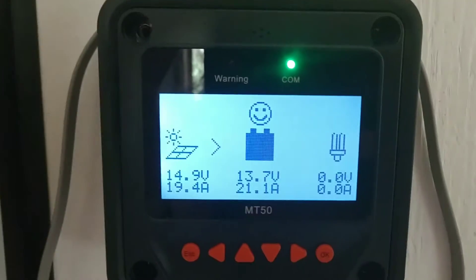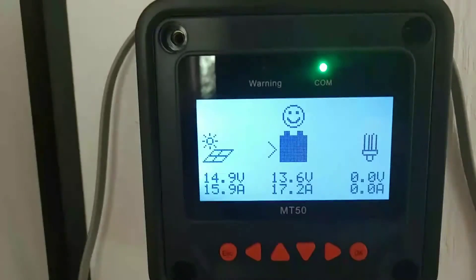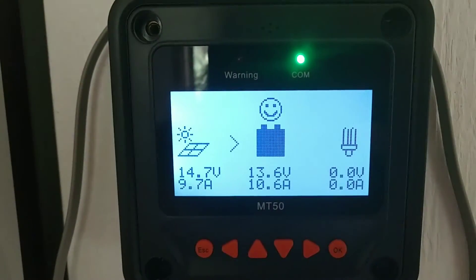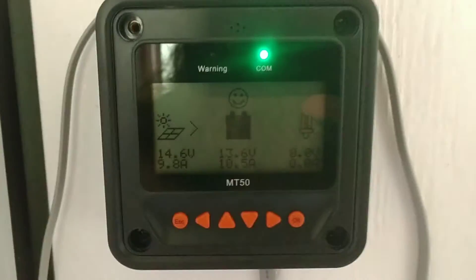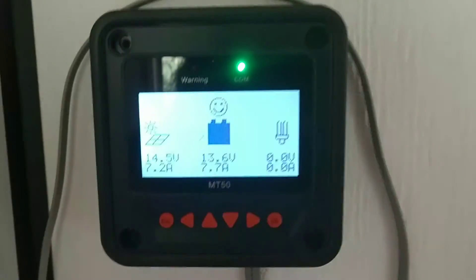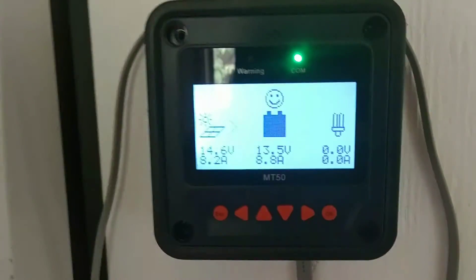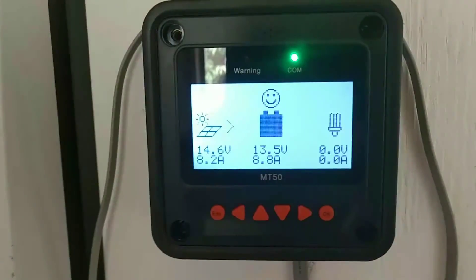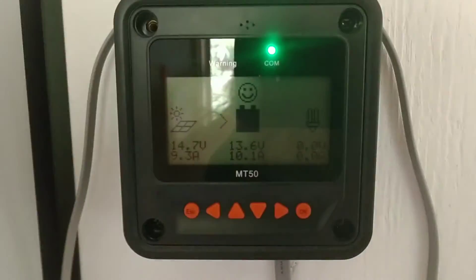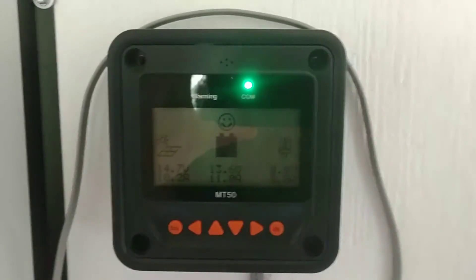Right now it just bounced up to 21 amps at 13.7 — it'll hold that for about the next couple of hours, and then it'll push past that and go up very quickly to its boost charge. I hope this helps those of you who might have been struggling with the same thing. For the past few days it's been working extremely well — I've been getting a full charge every day, even with a little intermittent clouding. On discharge, it's yet to drop below 13.2; it just holds steady. Anyway, have a good day — hope this helps. Smash that thumbs up if you feel for it. Take care.